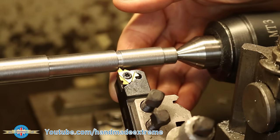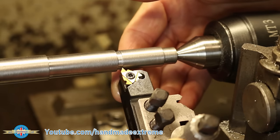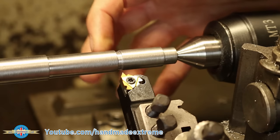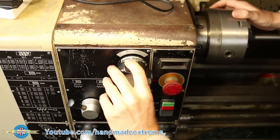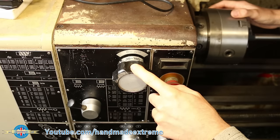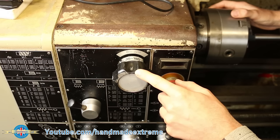I've cut a little groove in just here so that when I'm bringing the tool across I've got a little safe space to stop the tool before it runs into the next feature. For screw cutting we want the machine running nice and slowly — on this machine that's 35 to 180 RPM. Running slowly means we've got more time to switch off the feeds before we crash the tool into the part.